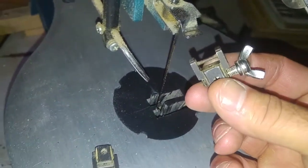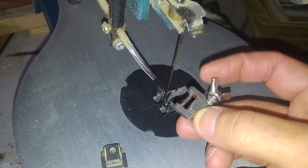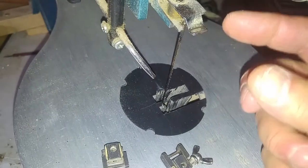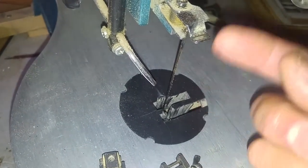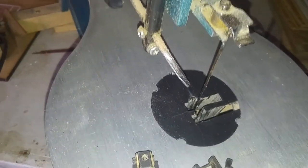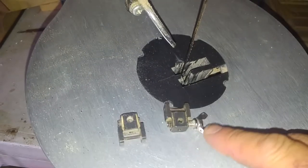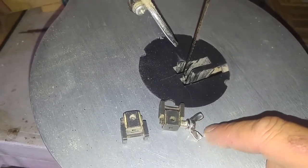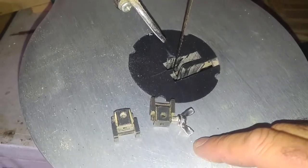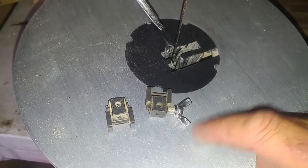What I did was - I've seen people weld stuff on these - I bought a little M5 wing bolt. Now when I want to change the blade I just undo that, it drops down, put it back through the work, put it back in and nip it back up. It absolutely saves loads of time. If you haven't thought of doing that, that's the thing to do. I'll put a link in the description - I think it's M5 - you get two or three for pence off eBay.